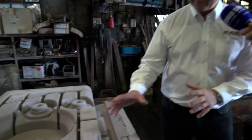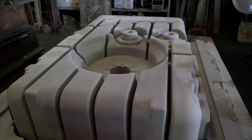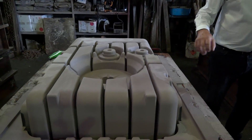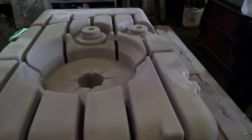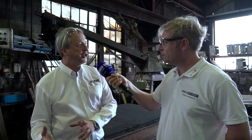The next stage is assembling that 3D jigsaw puzzle of sand pieces into the mold. We have a bottom half of the mold here, and the core is placed inside — this gives the interior definition of the casting. Just behind you is the top part of the box, which will be brought over, dropped over the bottom half, sealed up, and then the metal will be flooded into the cavity to create the casting. Everywhere you see a gap is where the metal will flow — the sand core shapes the interior void.